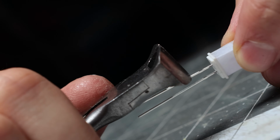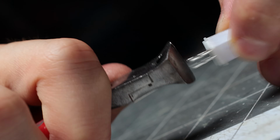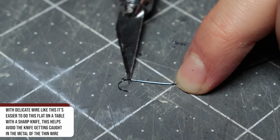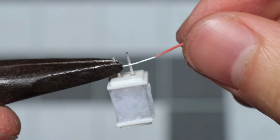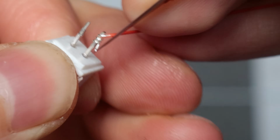Then I started playing with the LED. I cut the prongs down to 3/16 of an inch long to fit inside the arm with a little bit poking out, and used some cheap 0.5mm thick wire to connect it. I cut them each down to 4.5 inches long and stripped the ends about 1/2 inch from each end, and then bent each one tightly around one end of the LED, holding the tip in place against the opposite prong while I wound them up. I also bent the tip around afterwards to avoid crossing wires.